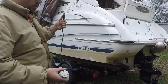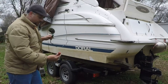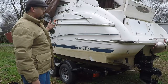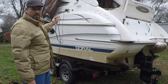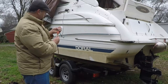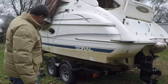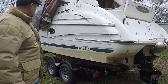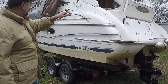It's real simple — it just plugs into your shore power. When the boat's at home, no problem. Plug right into here, drop cord running into the house. You can run your battery chargers, do some cleaning on the boat, or sit in the boat and listen to the stereo or watch TV. When we're out on the lake, I'll take my small Honda generator that stays in the engine bay, set it on the swim platform, run the generator, plug in, and run it out to the shore power.